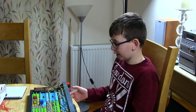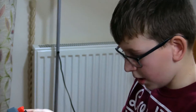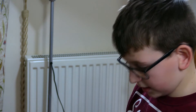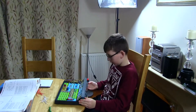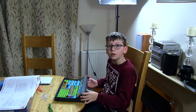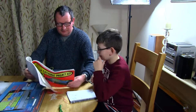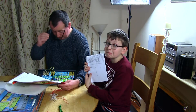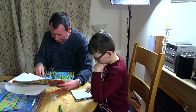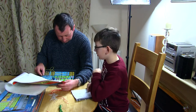So the photometer - what does it actually do? It's for measuring light. When there's light, the meter will go up. It's not doing it though - time for dad to check it. This is one of the problems you can get: if you go ahead of yourself, sometimes you get the numbers mixed up and the wiring sequence wrong. I'm going to check: 58 going to 143, which is correct. 60 to 168.